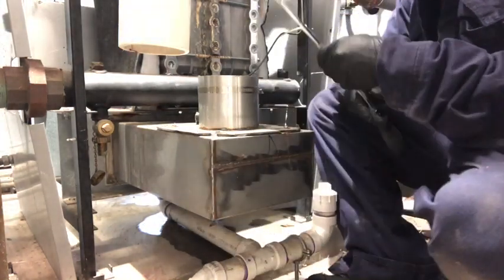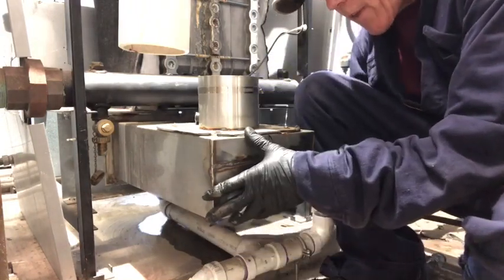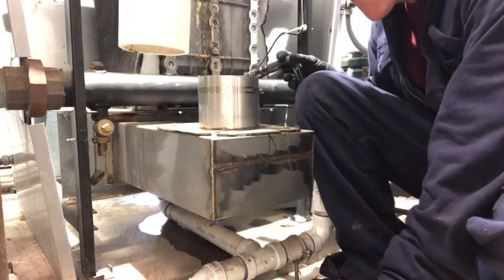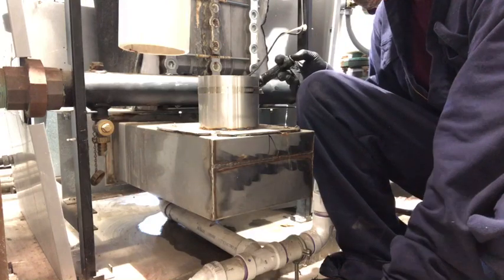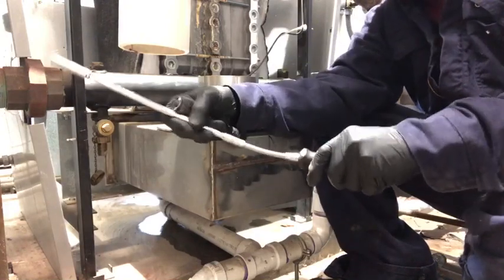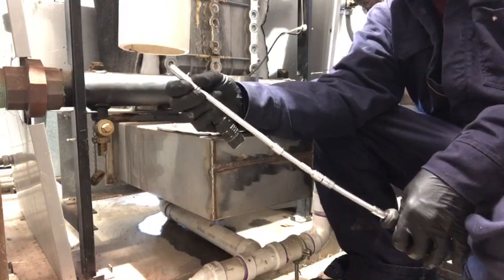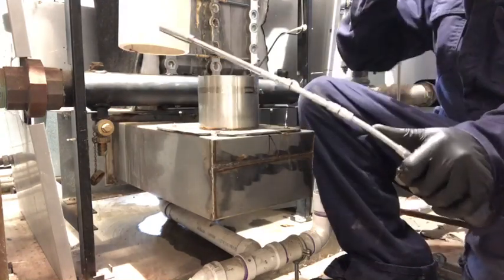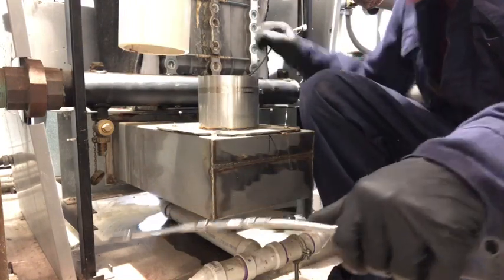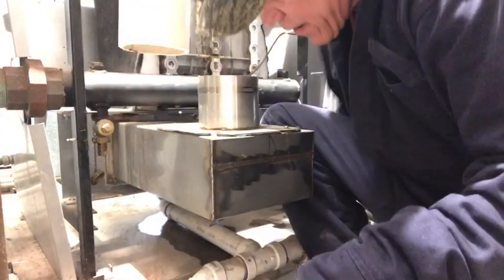Okay, to take this collector off, you got 3 nuts at the top and 3 bolts at the bottom. Just so you know, I already kind of pre-loosened them because they are really aggravating sometimes because they're so small, they're hard to get to. This is one of my tools that I use. It's flexible. It helped me get back inside of it. I use an extension along with the 7mm deep well. And sometimes when I put them back in there, I'll use those screws that I showed you prior before I got started. And you just got to get down in here and go to it.